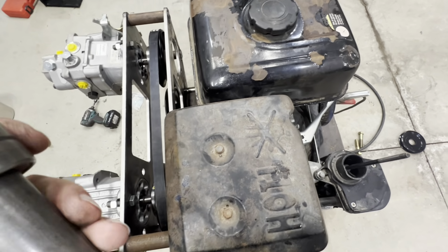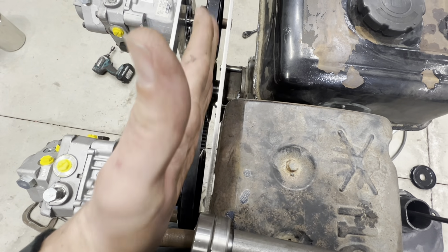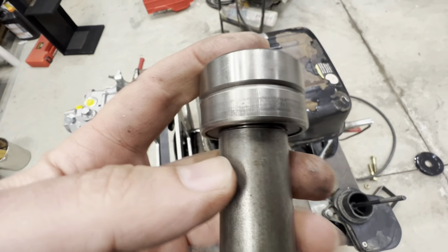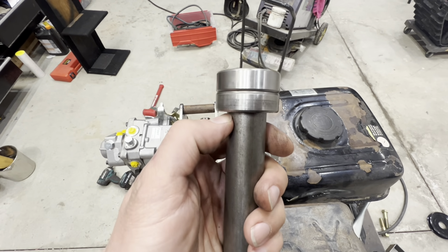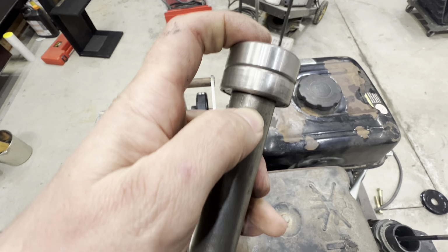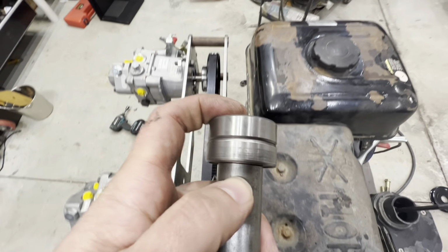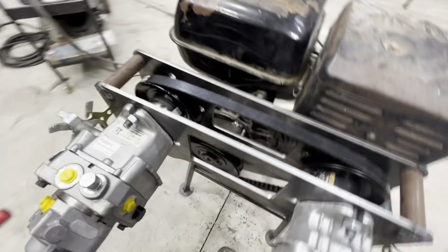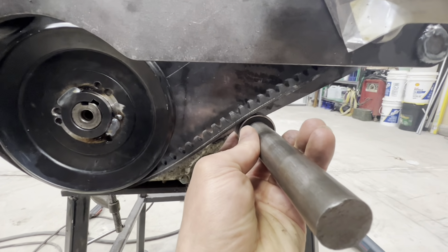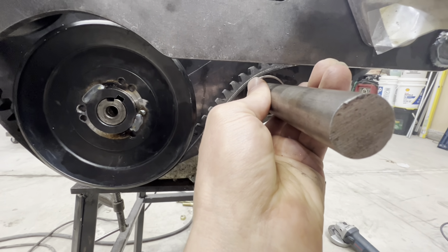What we're going to do is come up with an arm that's going to pivot down below there, and it's going to attach right at the edge, so that we can bolt this whole stack of bearings and this little collet, if you will, onto that arm. That's going to be our idler wheel. It's going to be in this area here, and it'll pivot up into place to provide tension on that belt.